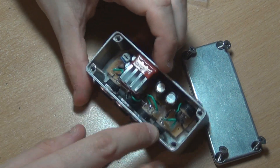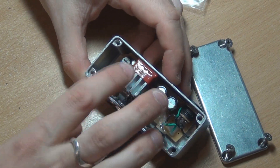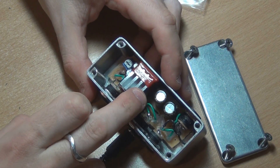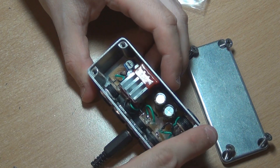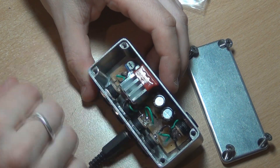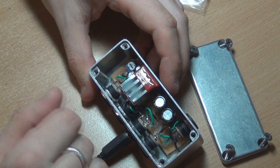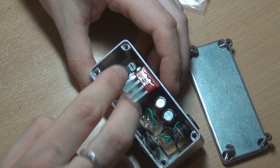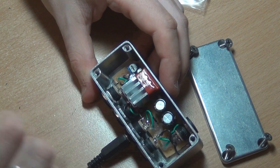It would also save space because it definitely got very crowded around where that heatsink is. The heatsink is connected to the power regulator, and you don't want the heatsink touching the enclosure because the enclosure is connected to ground. So you need to separate the heatsink from ground. I know people might say the tape will insulate it, but it got so tight I just had to use it — it's better to have a slightly warmer heatsink than one that's touching ground.